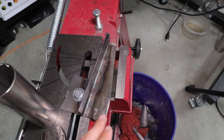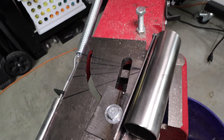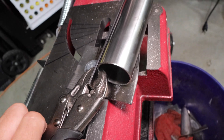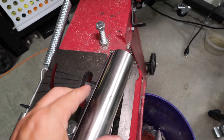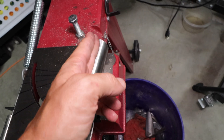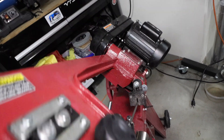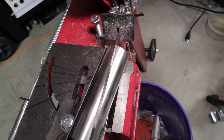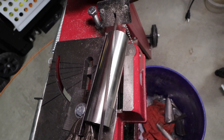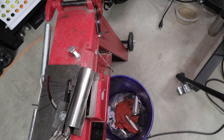I have another video — I can drop the link — of how to make this jig. So put it in there like so, take the channel locks and lock it into place. The first cut we're going to make is our 180 degree cut — we're going to slice it right down the spine here. One thing to be cautious of: when you drop your saw on it, take your time getting the first initial cut going, because the blade will have some flexion and could bow outward, giving you a concave cut. Just take your time, let the blade get started and then let it go.